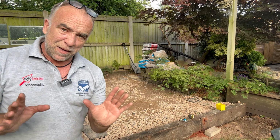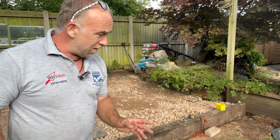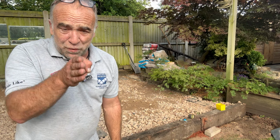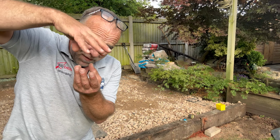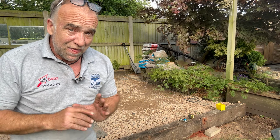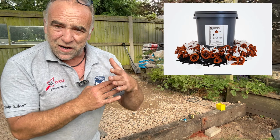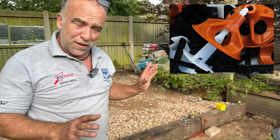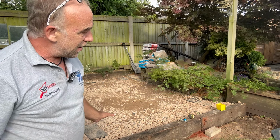And then the last bit of advice, spacers. Tyler's Tool sell these, I've been using them for quite a while. It's those Vite clips, where it's like a T shape, goes underneath the tile, and a bit sticks out, and you've got that little screw cap. If you're a DIYer, that's gonna help you out. They do these buckets where they've got the screw caps, Vite clips, and they've got spacers. So that's gonna be a bonus for the DIYer trying to do something like this.